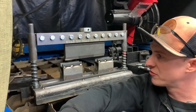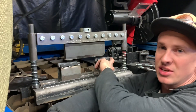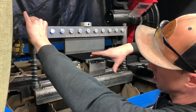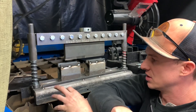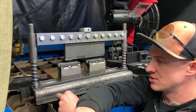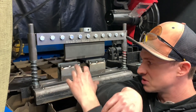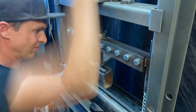That's pretty much a wrap. I have a fair bit of welding left to do to button everything up. At this point you can pretty much get the gist of it. I've got lower dies that are movable and I can put them into any position I need, and I've got the ability to grow upward with larger stock, making larger lower dies - if I had something that needed to pass through here that was even taller. So a lot of growth options for this thing now. This is kind of just one that I think is an important mod that anybody who's looking at these presses should probably jump on right out the gate. And if I can get the plates cut that I needed for this specific job, I'll try to sneak those in on the video too at the end and kind of show you why this was so important. So I'm going to wrap it up. Enjoy. Have a good one.